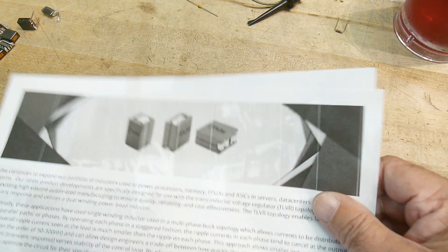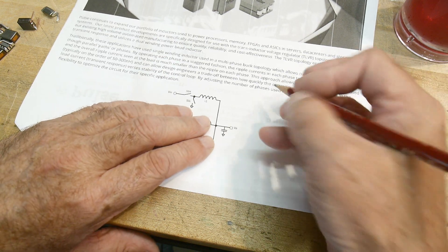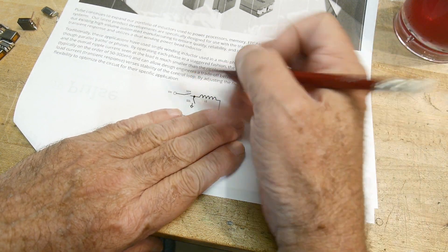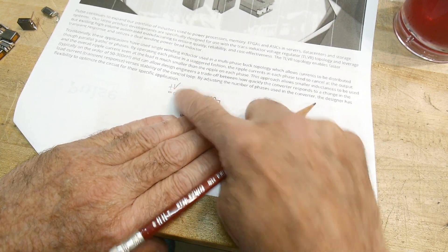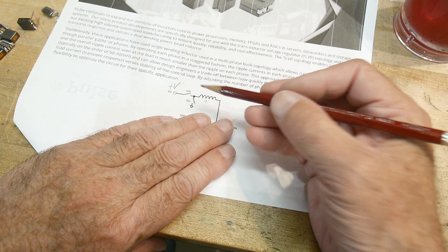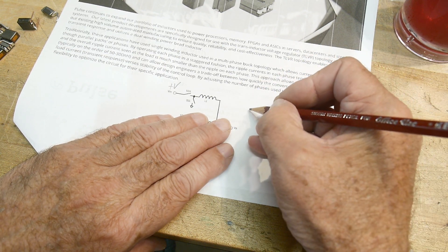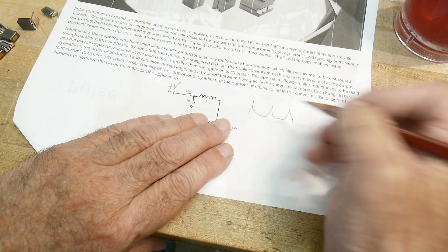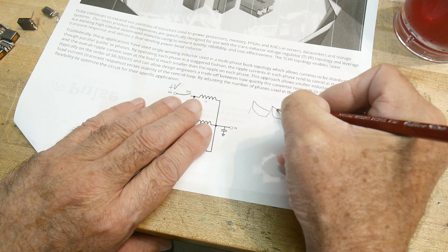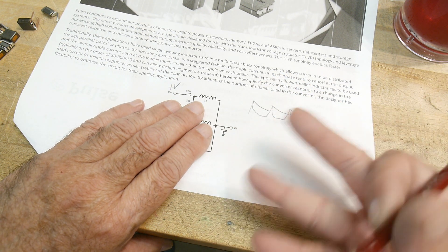How are they used? They're used in circuits I've never done before. They are inductors, so if you look at just one of these and you're going to make a switch-mode power supply, you have plus-V coming in, a switch to voltage, and a switch to ground — you're switching this inductor on and off. We've seen those before. You generate voltages, and you get this spike, spike, spike with a droop in between. The capacitor filters it, but it's not smooth enough and you can't switch fast enough.